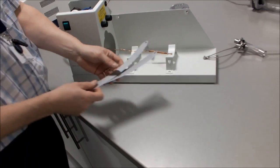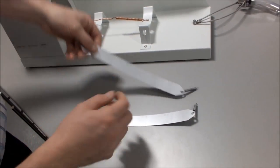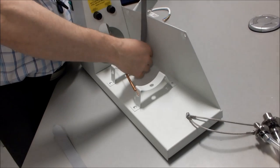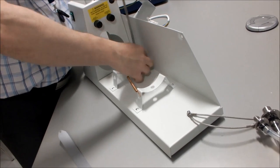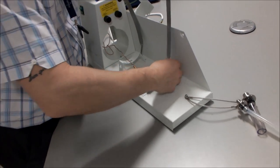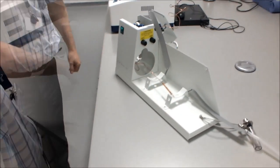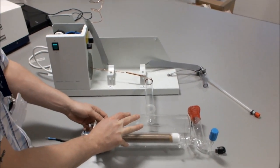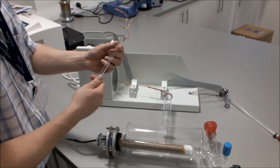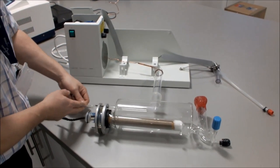Take the two metal straps from the gasket kit, each with a spring on one end, and attach the spring to the back hook on the cradle. Take the boiler thermostat tube — it comes with a seal — and place the seal approximately 30mm from the end of the tube, then place that into the boiler. Fit the white screw cap onto the boiler thermostat.